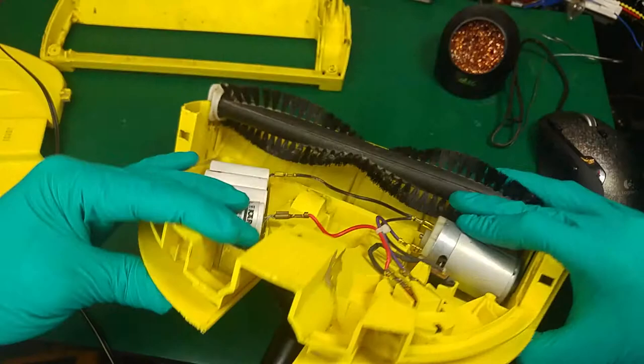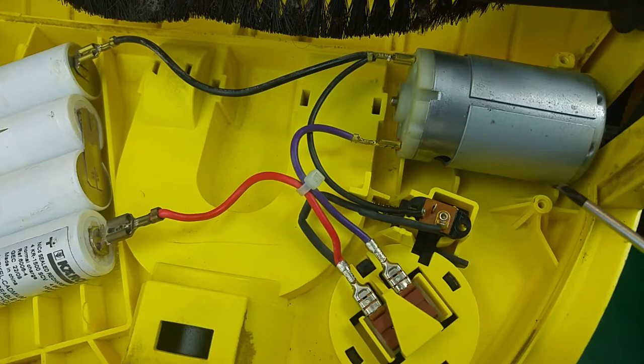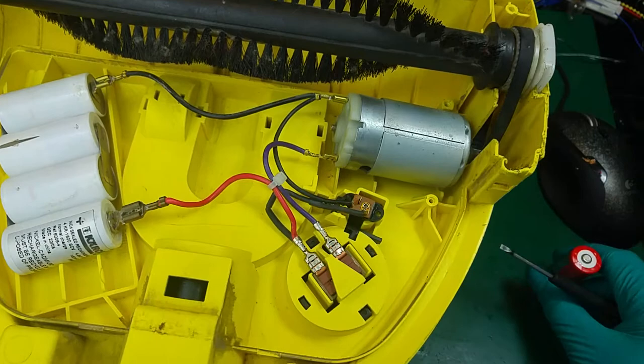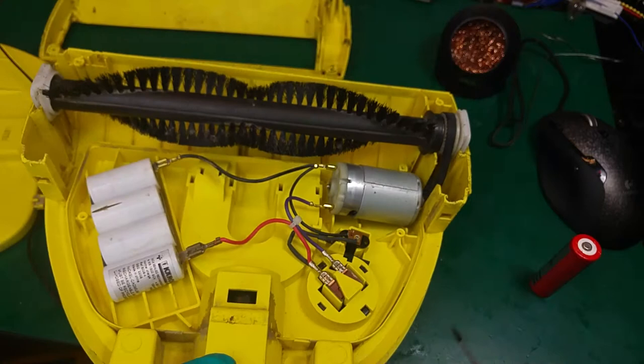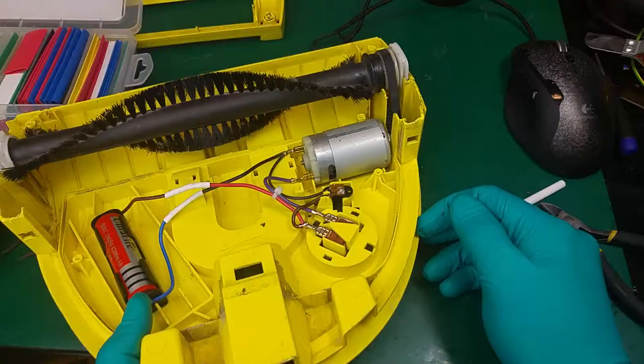It was working pretty decent, so I would like to save this. Over here, for me that looks like a diode protecting from reverse current flow to the power supply. So if I decide to go with lithium-ion, I will have to remove that diode for charging, and of course we are not going to use the supplied charger, but just a standard 4.2 volt. So let me try the lithium-ion and let me test if it's working.